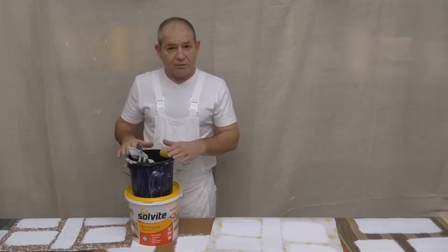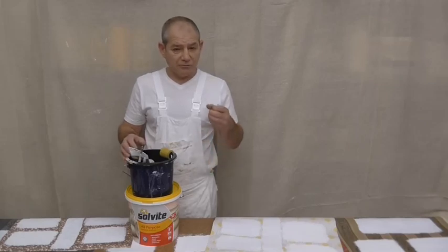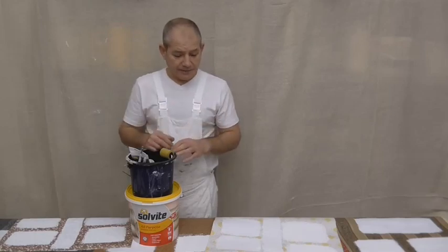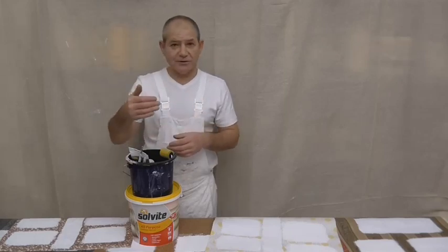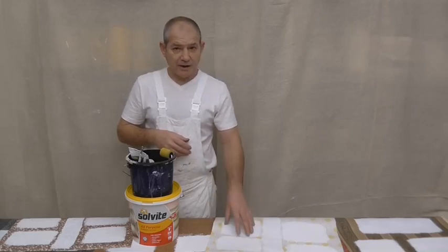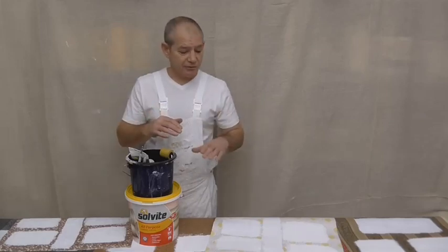So you may go around and glue a lot of the edges, but inevitably, as soon as you put your paint on the paper, it'll rework the paste. It can soak into the paper and you'll get bubbles, edges lifting. Certain vinyls, washable vinyls, the moisture won't get through, it'll sit on the surface. So yeah, some papers definitely, once you put the paint on, it'll start to absorb it and you may have problems. Leave it to dry, don't touch it, just wait.